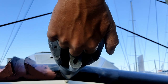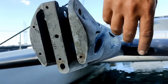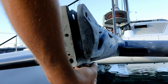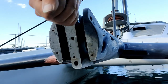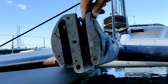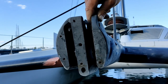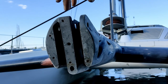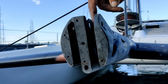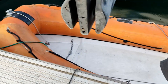And the port halyard would actually come out. So there was a gate across here, and the guy would come up the mast and open the gate. He would take the port masthead halyard and flip it over backwards, and it went over a little sheave here. And this is what they actually hoisted the main on. There was no mainsail halyard and no sheaves and all the rest of it, so it made the whole top end of the rig a little bit lighter. So they'd hoist the main on this port spinnaker halyard, which is now facing backwards.